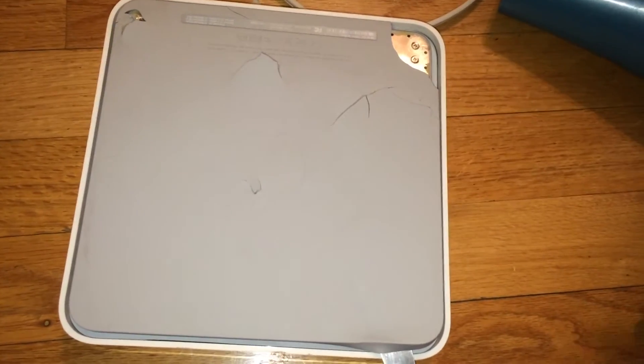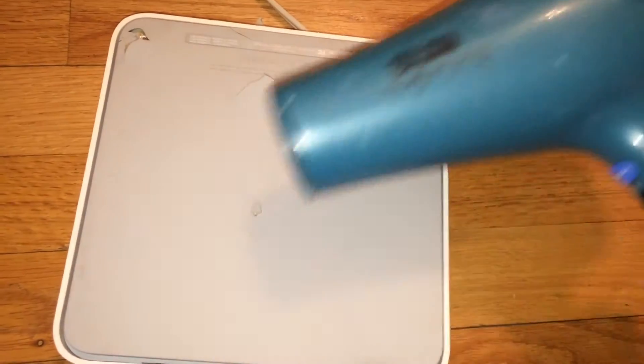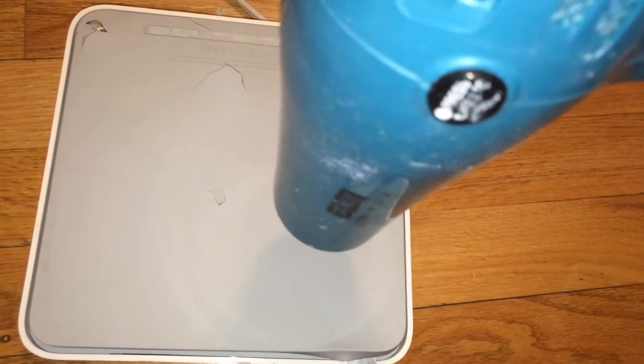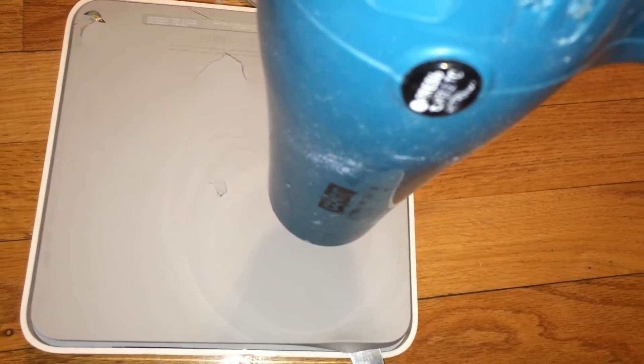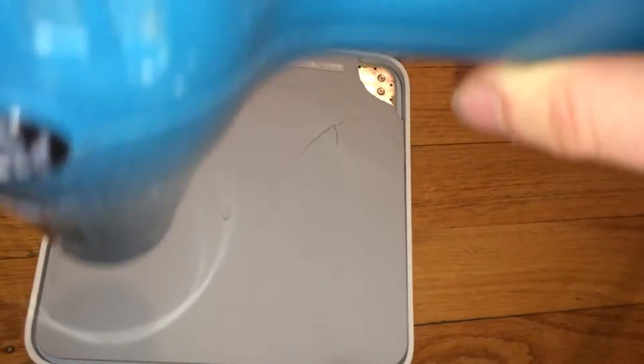If your pad starts ripping and you don't want it to rip, you may want to use a hair dryer to heat it back up and just keep heating it as the glue hardens again. Heat it up more and keep doing it until you get to the end. Once we are done with everything you can heat the metal back up and the glue should re-stick the bottom. To keep from tearing more, you can use the butter knife to get under and just work it around the glue, trying not to shove the butter knife through — just keep working it up.